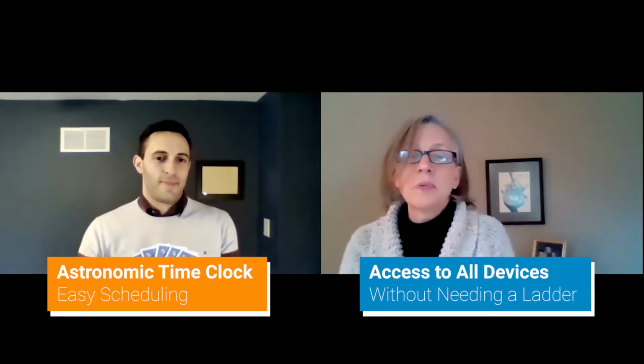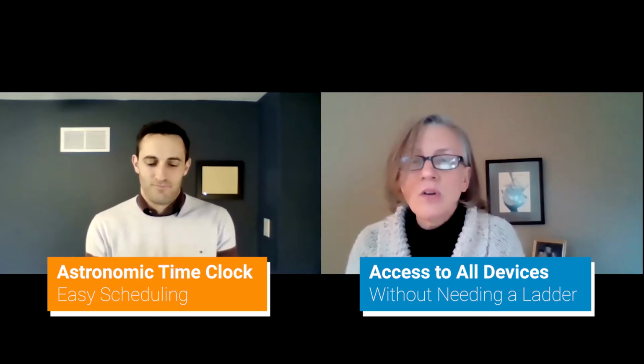All right, Ray, what do you got for me? I have 365-day astronomical time clock. I have access to all devices below the ceiling. Power packs, load controllers. You don't need to locate them to touch them. No ladders. I'll play automatic load shed. I got some energy usage data. Contact closure for emergency lighting from a fire alarm input. Don't see that anywhere, but I got BACnet.